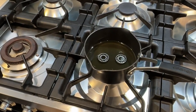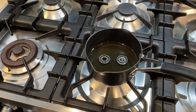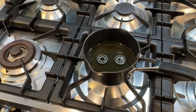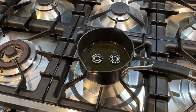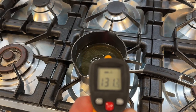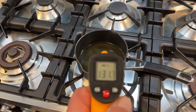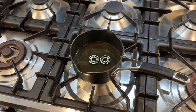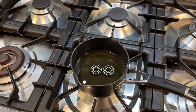Once we've got it up to temperature — I'm looking for about 110 to 120 degrees C — I'm going to leave it there for 15 minutes before I pop it onto the shaft. They're now at 130 degrees. That's about as hot as I want them, so I'm going to turn it right down and try to keep them like that for about 10 minutes, and then I'm going to try them on the shaft.